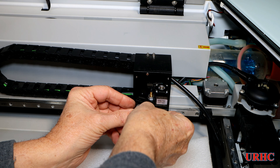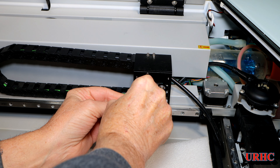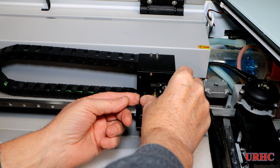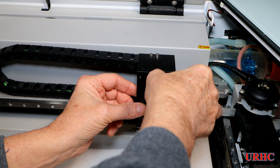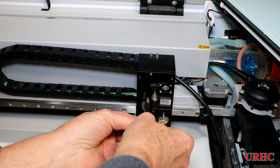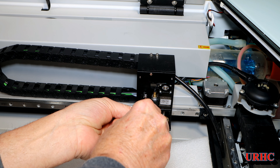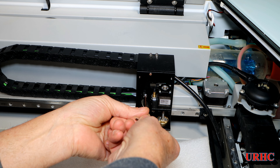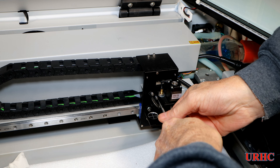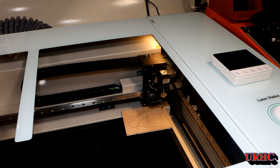I found out that some 16-gauge little brads actually fit in those preliminary alignment holes to get it started. I just hung it in place with the two brads to have the location pretty much set, then put the screws in. One warning: don't over-tighten these screws — it's very thin aluminum plate they go into.